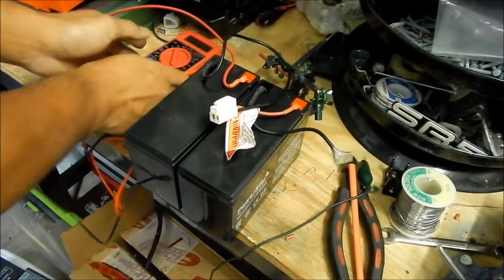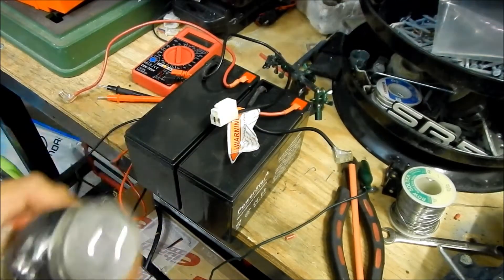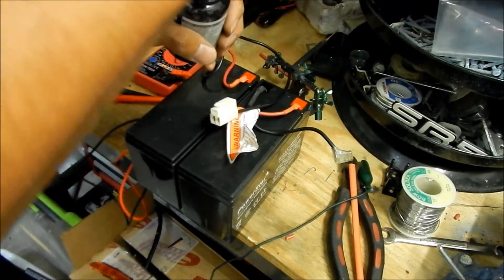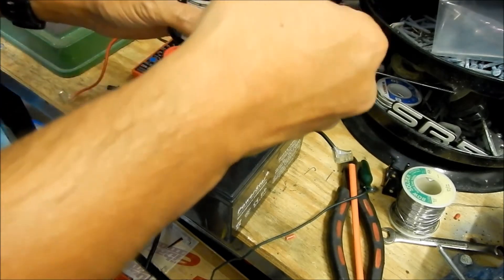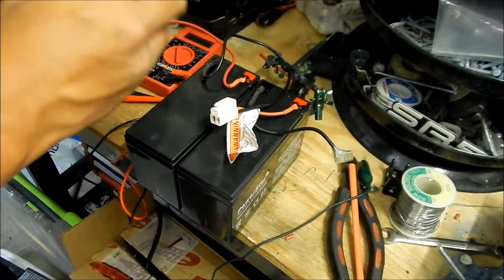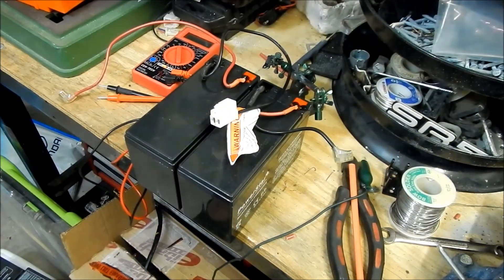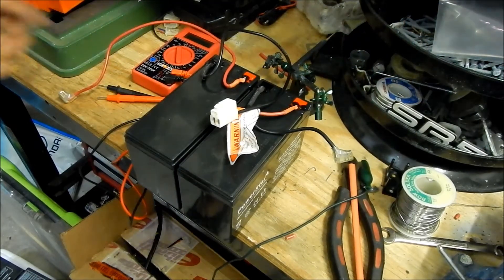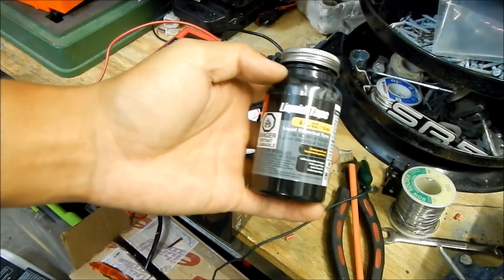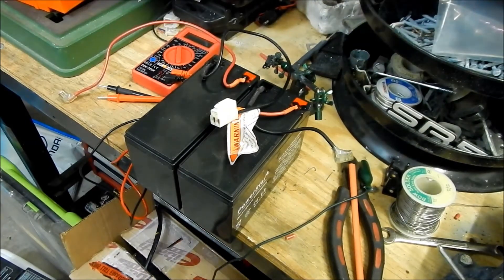Before we put it in, I'm going to put some liquid tape on the terminals here on the backside, just to cover that exposed section so it doesn't short on anything. Liquid electrical tape is what it is — they sell it in spray form too but I wouldn't use the spray. Pretty much just as good as the original. There's a little area back there that's exposed, so that's why I put the liquid electrical tape there. You could put regular electrical tape on it, but if it gets hot it just comes right off.